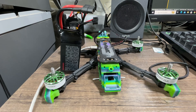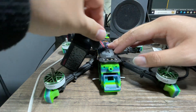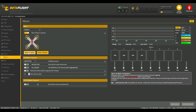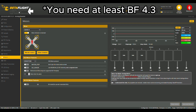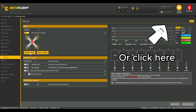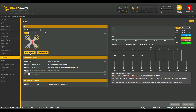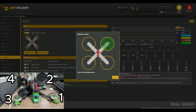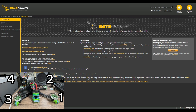To fix the issue, go into Betaflight with your battery plugged in and go to the motors tab. If you've flashed firmware 4.4 or newer, you should already have the reorder motors and motor direction function. Go to the reorder motor function, click 'I understand the risk', hit start — make sure there are no props — and as each motor spins, click on its corresponding position. Work through each one, then hit save. Your motors should now be rearranged to match the image.